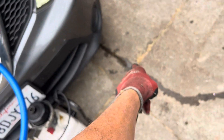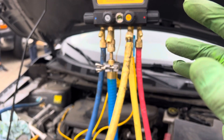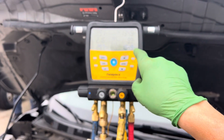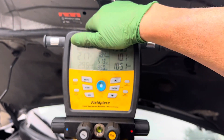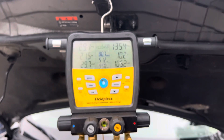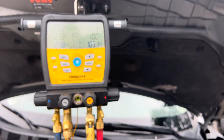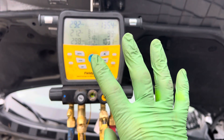The system was blowing nice and cold, tons of water was coming out with 420 grams. It's an overcast, cool day. But the key takeaway was: look at the superheat and subcooling — don't look at the pressures. Totally keep the pressures out of your vocabulary. Now it has 500 grams.